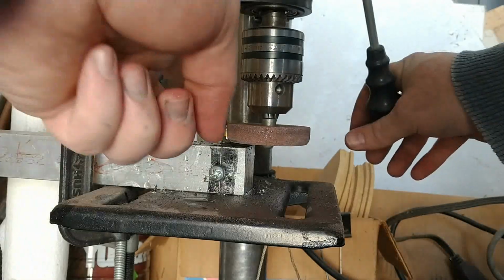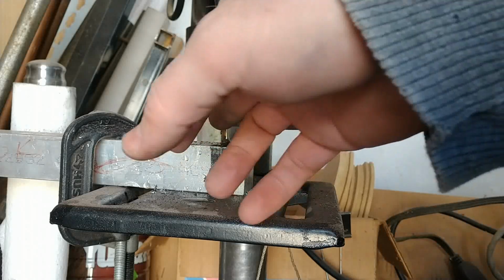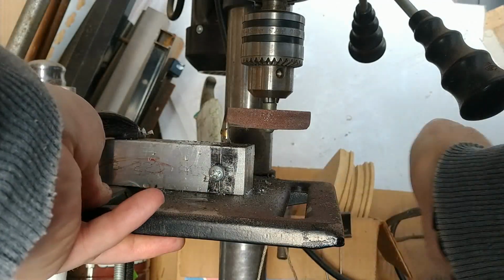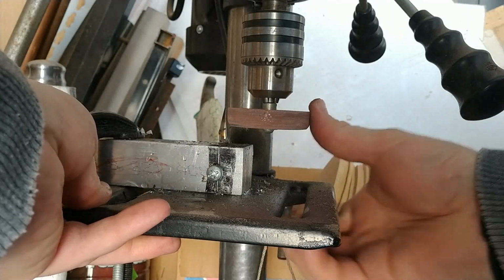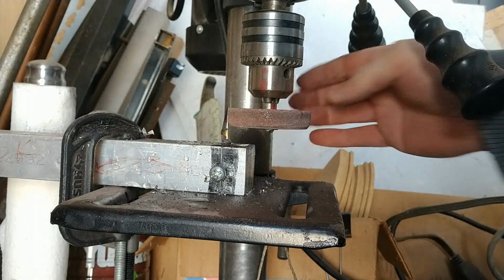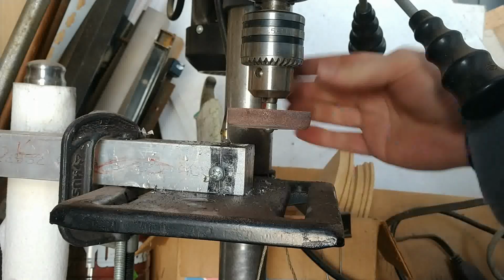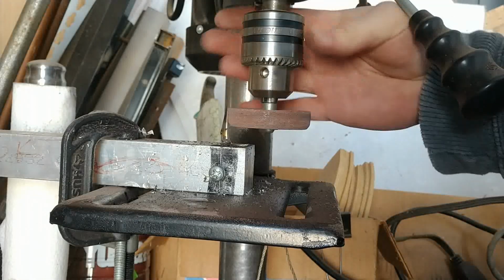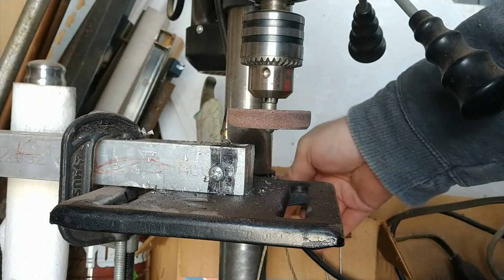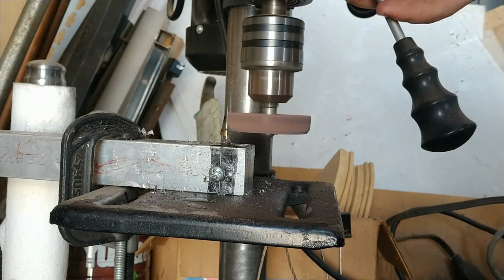I put a little bit of heat into the tip here, which was a mistake. Anytime you reset, I would start out a little bit with it loose. So what I'm saying is, make a little bit of a gap, give it a full rotation, make sure it doesn't scrape. Put it in contact, feel that it's scraping lightly. Give it a tap, tighten it, no scrape. And then basically from snug, very gradually increase it in. We don't have a lead screw or something.